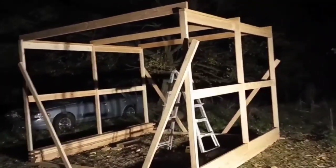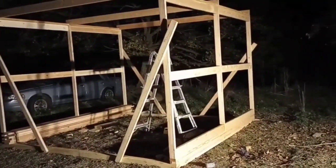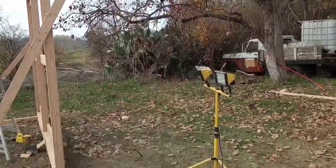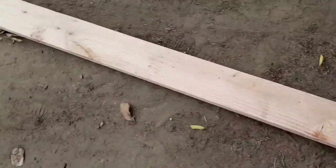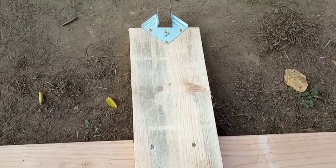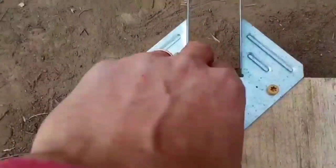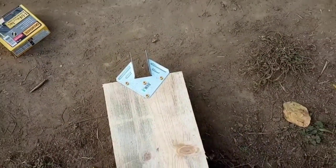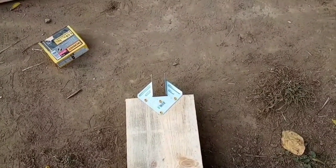I got it braced up, but I didn't have the lateral stability without the braces that I would like. I'm deciding that we're going to run the rafters out long and get about triple the space, so we're going to do the rafters a little differently. Those are the ceiling joists I cut — exactly halfway. Put some scrap two-by straight up, and then with a hurricane tie, we're going to run a ridgeline beam there and then take our rafters. For our angle, we're going 3 and 16 — it's going to end up being an 11-degree cut at the top.